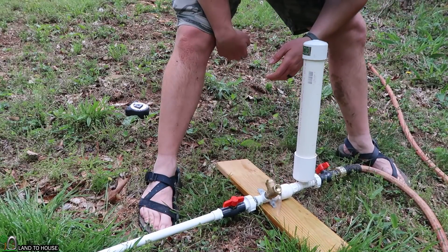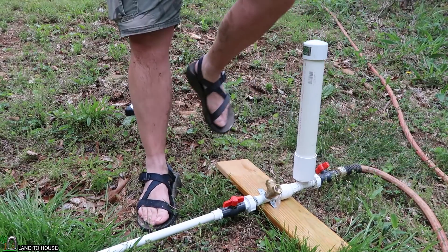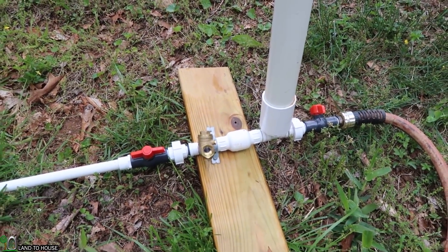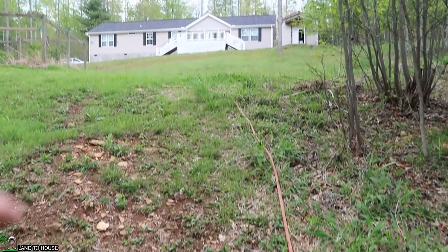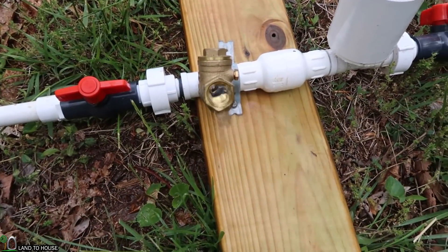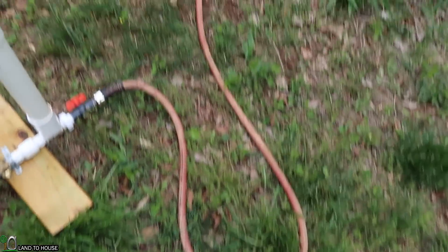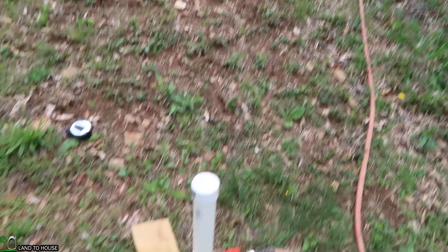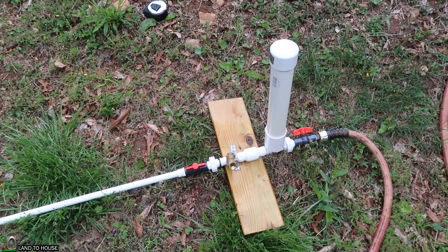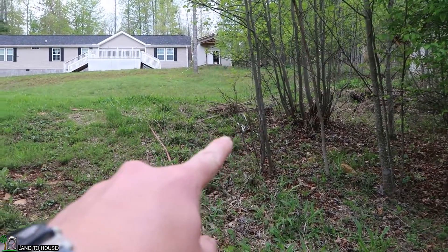Let's cut the valve way to the side. And it is functioning, but just barely. If I were to let the pump run like this, it would probably get a height of somewhere around 6 feet or so up this hill. So you're looking at about right here is how high it would lift. Not very much. I just opened up the delivery pipe right here, which goes along this garden hose and on up the hill. So I'm going to let this sit for about 10 minutes and we will see how high this 1 foot of input head pressure with a tilted waste valve will lift. My assumption is about even with this stick right here.